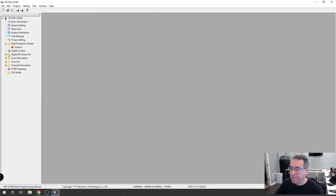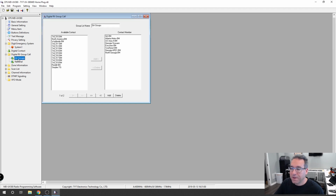Now, moving on, we have the digital RX group call. I'm going to go through this very simply because I still am a little fuzzy on the benefit of having multiple ones. I wish there was an easy way to switch them on the radio. However, what this basically means, a digital RX call group in the sense of this radio, the TYT MD-UV380, is when anything is in this call group, it will immediately interrupt what the radio is doing and play basically whatever's going on that talk group, that frequency, that channel, whatever the case is.